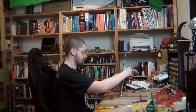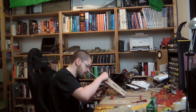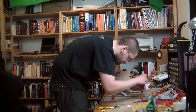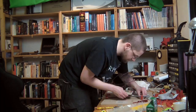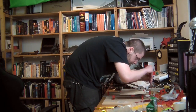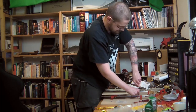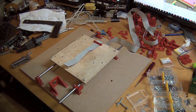Ribbon cables look really neat, and what you can do easily is add a sheet of polypropylene strip, which enforces the minimum bend radius. That means your cables cannot break — they roll off like they're in an energy chain. It's really cheap and it looks really good. You will have no more cable failures, it's really easy to organize all your cables, and you have no longer cables hanging around everywhere. Previously I even had cables caught in screws. With this setup, that can't happen.